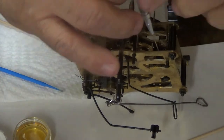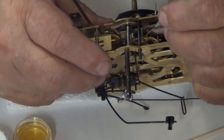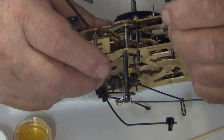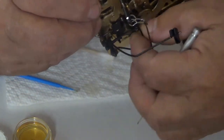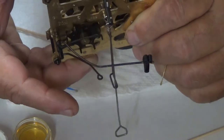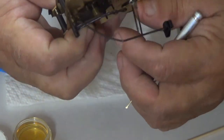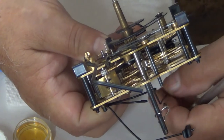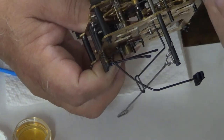Let's see if I get my big fingers out of there. Okay. You touch it. Just touch it on the very top of that tooth. Every other one. And then you can just move this. So I might have to put a little pressure on it. Oops, hold on. Okay, put a little pressure on that gear. Oh, let's see. See how that's moving? So you move it about 8 or 10 teeth, and then you can touch it every other tooth